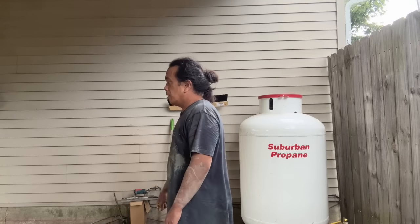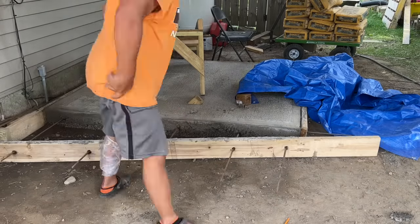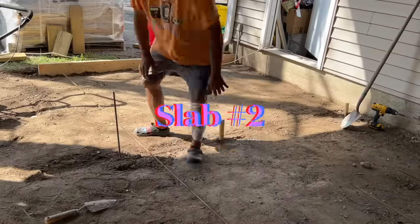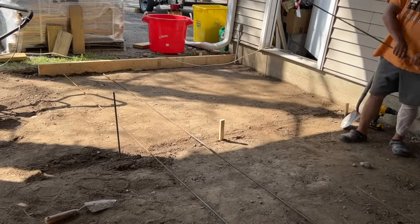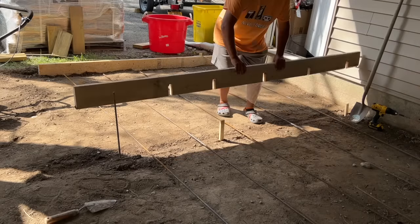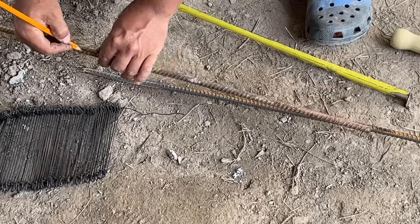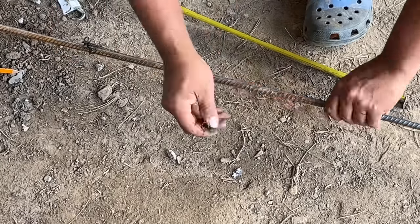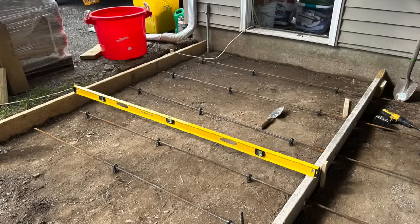I'm going to cut the next slab in half to make it more manageable, since my dad will be heading home and everyone has their own things going on. I'm slowly taking apart the form and sliding it out, then using my jigsaw to notch those same holes so the rebar matches what I did on the first slab. I bring the wood over and line everything up. Remember: number three rebar, 18 inches minimum overlap. After tying everything in, I made sure the slab was sloping toward the driveway.